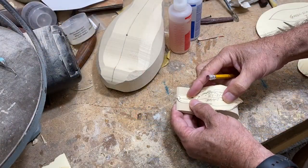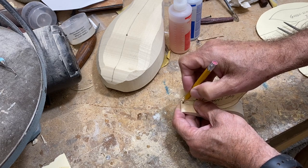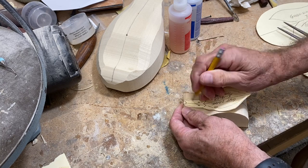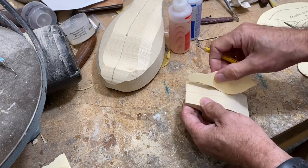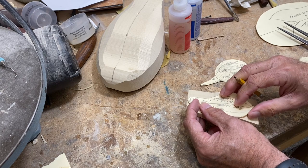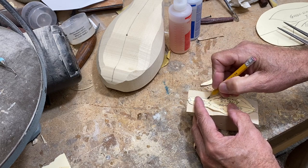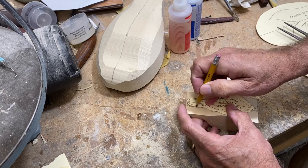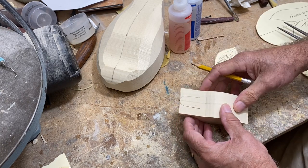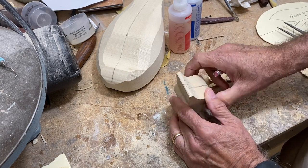I had made this top-down head pattern, so I'm going to use that to lay out the bill outline and trace that on, using the center line to keep it in the middle of the carving — above and below. As I'm coping out the bill, especially on a small bird like this, we can't afford to lose any wood that is supposed to be there. I'm going to use the coping saw carefully, and by having an outline on both the bottom and top I can make sure I don't get off kilter and cut off too much wood.